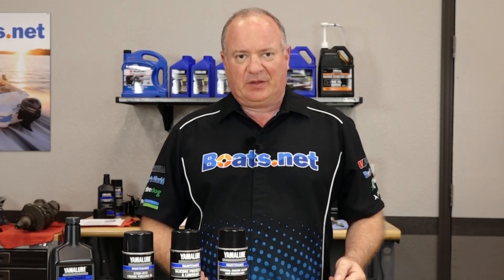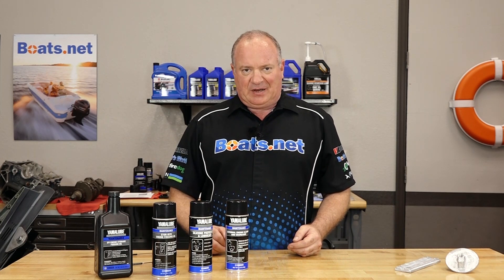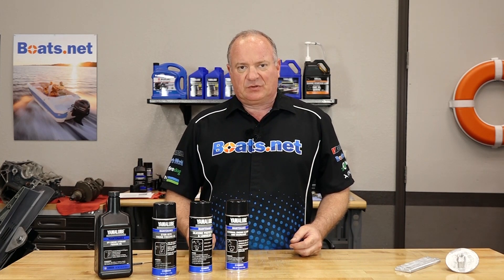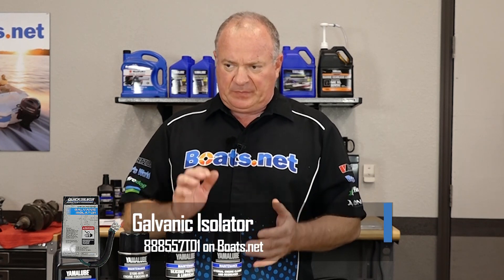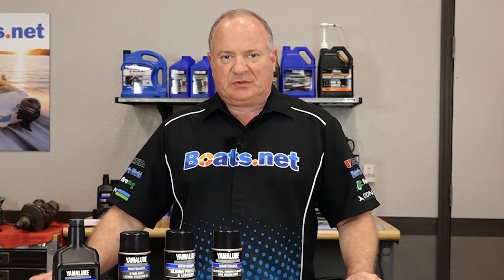Do every single connection on your boat as if it's going to be placed underwater — that is my rule of thumb. Now there are instances where your boat is doing exactly what it's supposed to, but the dock is not, and you could be getting stray current back to your drive through the actual shore power system. To combat this, what I would recommend you install is what they call a galvanic isolator. It is inline on your AC side on the ground, incoming from the shore power. That will effectively block any type of current trying to travel through the dock out to your boat and into the water. Cheap insurance, and believe me, if you don't have it in place, it can eat that out drive alive just like that.